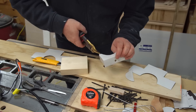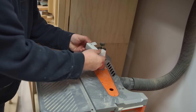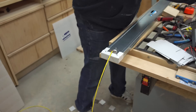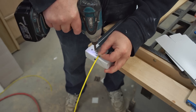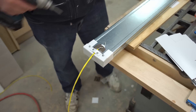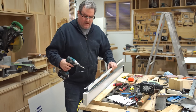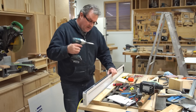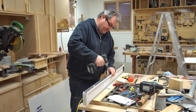Even though these won't be moved after I put them in — unless I build a new workshop. I want to make sure the wire is not just held by the solder on the strip, so I'm going to screw on a strap and drive in a couple of self-drilling sheet metal screws to hold it in place. With the end caps on and the wire secured, I can put the cross T on to trim out the other side. The fixture sits in the T-bar grid, and I'm also going to drive a screw into the side of the fixture to secure it.